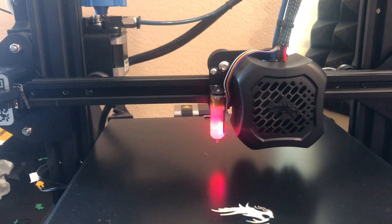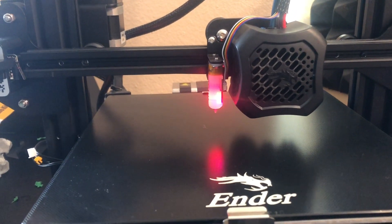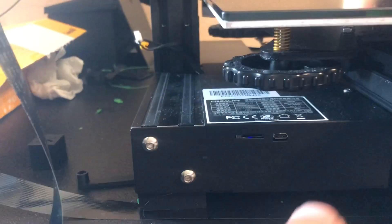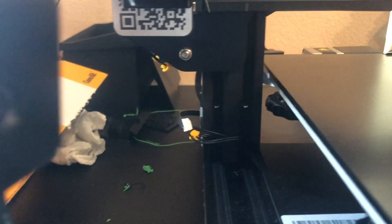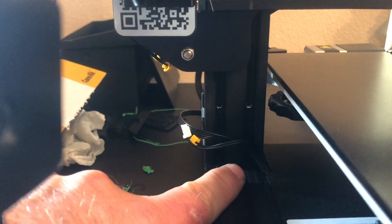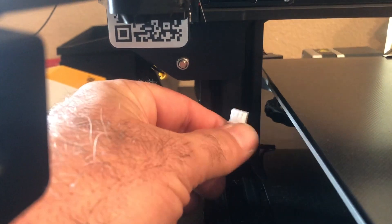You're going to have to adjust your Z offset — mine is set at negative 3.22, but yours will be different depending on how level your board is. I'm using yellow 20mm springs; some of you are using stock springs or silicone spacers, so the height of your board will differ. Also, don't forget to unplug your Z limit switch — that mechanical switch you don't need anymore. I took mine off but haven't removed it yet; I'll do that next time I open the main board.